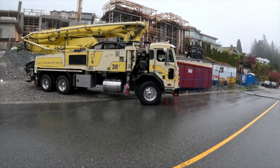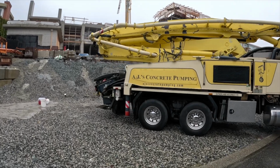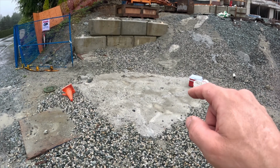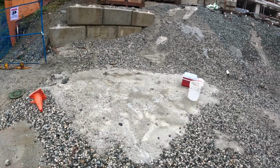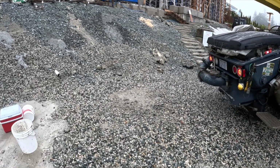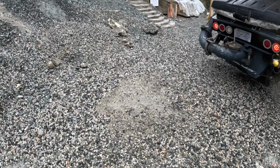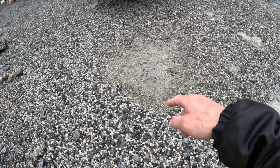Check back in. All right, just like that, we were all washed out. And look at this. I may have actually just sold myself on water washing. So this is pumping out, pounding air through, sucking back a sponge, dump the hopper, wash out. This is pump out into the mixer, pound air through, load the hopper with water, push that through, suck back a sponge just to be safe because of the mix. And yeah, that's the residual.